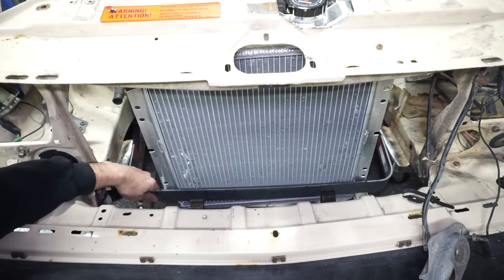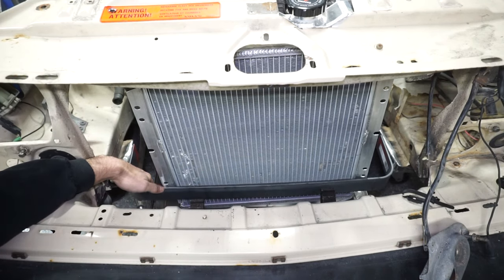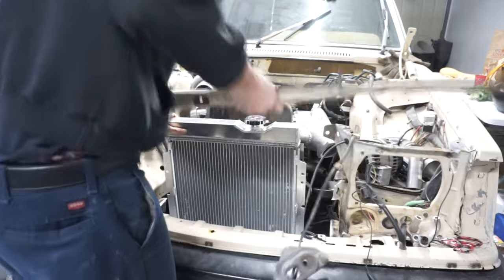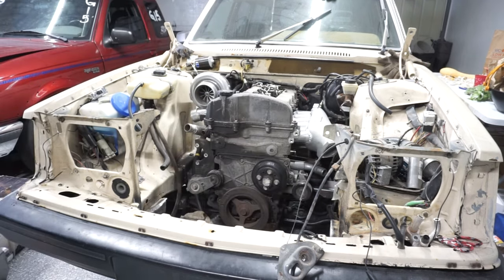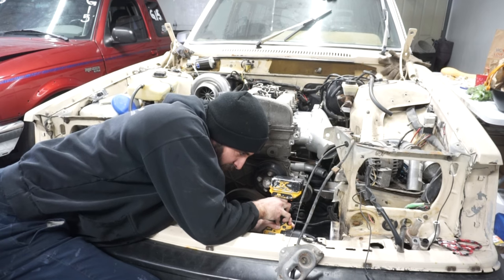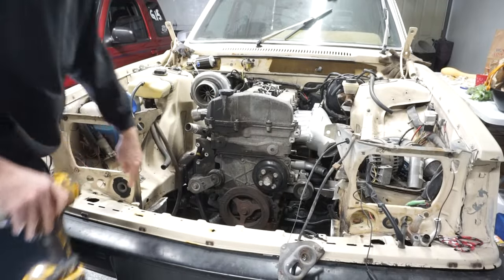I'll probably keep it like that for a little more stability. I could run a bolt through the bottom of this to bolt it to here, and the way I cut the other piece, the bottom bolt is going to be used — that should make a nice little bracket. I want to drill some holes; I used this little bracket and marked where I wanted the holes, drilled a couple holes in these guys. I'm going to use an M10 by 1.5 thread.